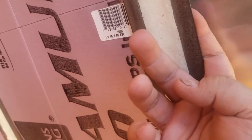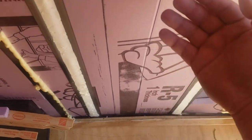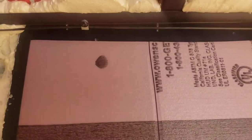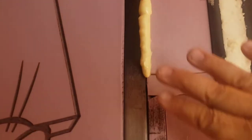You'll see also in here I have a gap behind my channel for the studs — I had to figure out how to get insulation in there. What I decided to do with my high-density foam board: I would cut my piece to the inside width of that channel, then put a slice right down the middle so I could bend the board, push it in in a V-shape, and pop it in so that it goes flat and stays in with tension. That worked really well. It's not clean, it's not perfect — I was cutting it with my old-school knife — and we still have to clean up some areas.